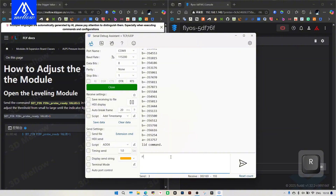Enter RT and send. The default trigger value is 20,000. The smaller the value, the more sensitive it is; the larger the value, the less sensitive it is. After our testing, we recommend setting it to around 10,000. The trigger threshold is now 10,000 — just check the last number. Our tests are relatively stable around 10,000. You can refer to this value, but this is only a recommendation — please calibrate according to the actual situation of your printer.